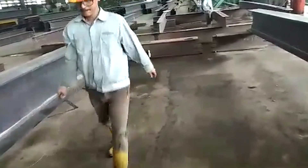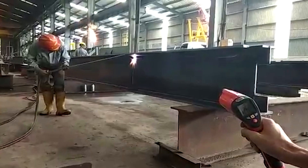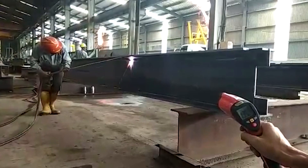The Bailings cambering machine is one of the biggest time savers in the steel industry. It is used to cold camber beams as an alternative to the traditional hot cambering method, which involved a lot of trial and error and could sometimes take days to perfect. With the Bailings cambering machine, we can take a day-long process and perform the same task in minutes by using hydraulic force instead of heat to induce a permanent camber in the beam.